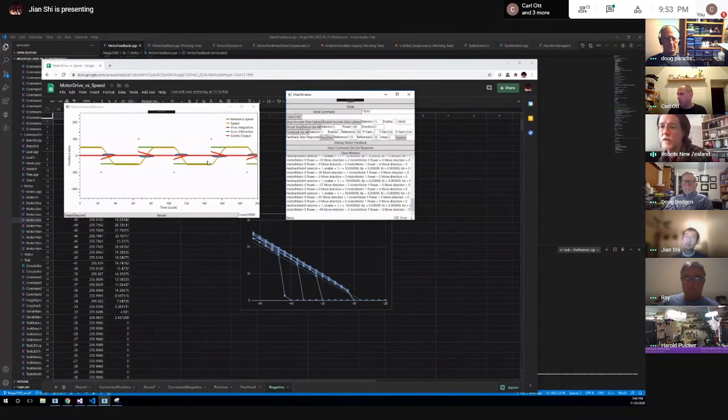I mean, Doug's point is that you have to kind of assume the center between the wheels, but in practice, I don't think you actually are going to get what you think. The encoders will give you the motion of, let's say on my robot, the front pair of wheels. The back wheels are effectively driving, but I don't have any sensing on them.